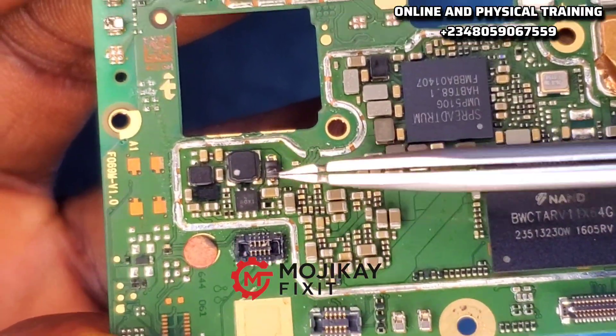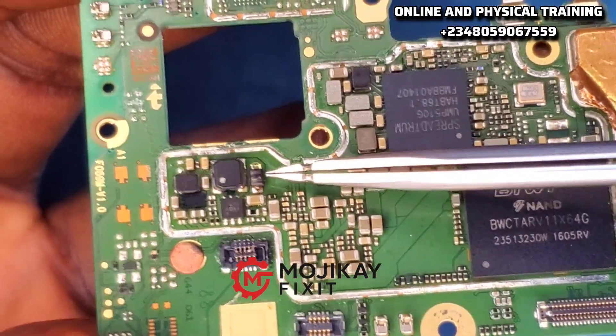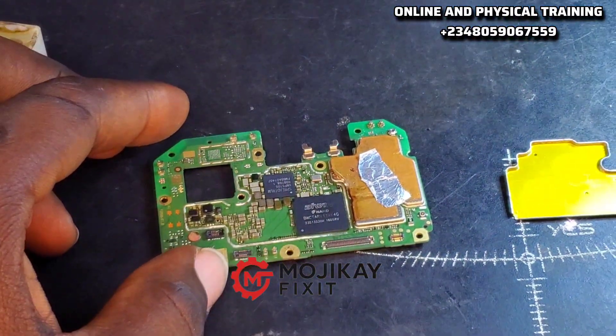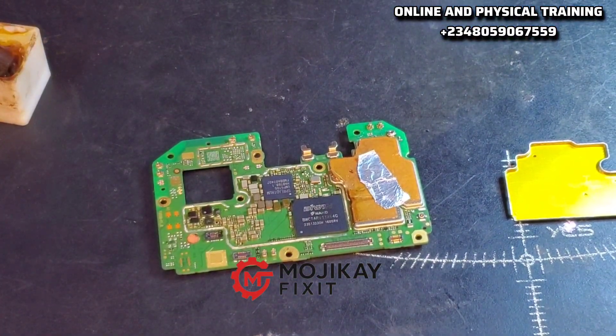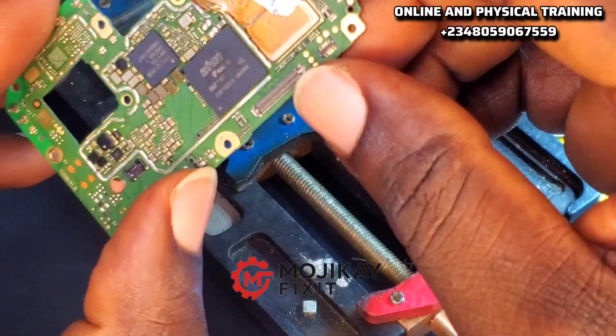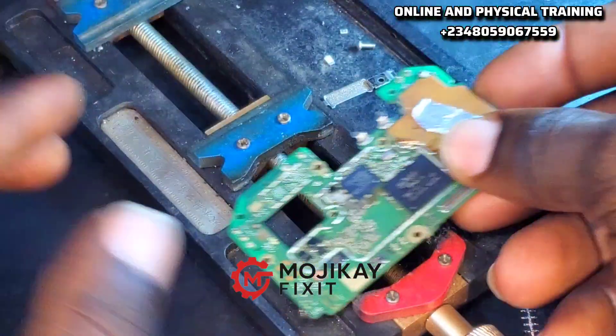The light section is comprised of the diode, coil, light IC, resistors, capacitors, and all that. Ladies and gentlemen, I've discovered that the diode is burnt — that was what I was pointing out earlier.